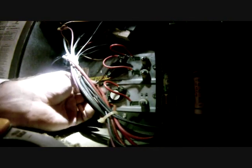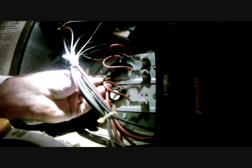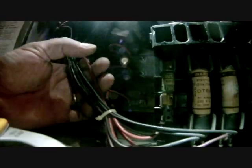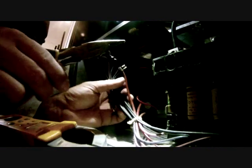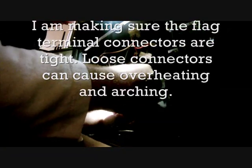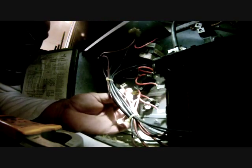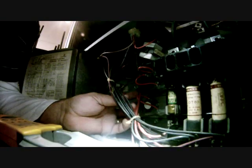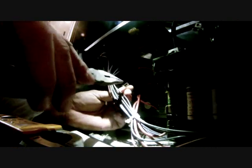I don't see any problem with this — hopefully it's just the breaker was off. I do see this one wire that has a little bit of discoloration. It's a little loose, so I'll tighten that up. That one's not too bad, but the other one up here is really discolored the most — it looks like it's had a problem at one point and gotten a little hot.